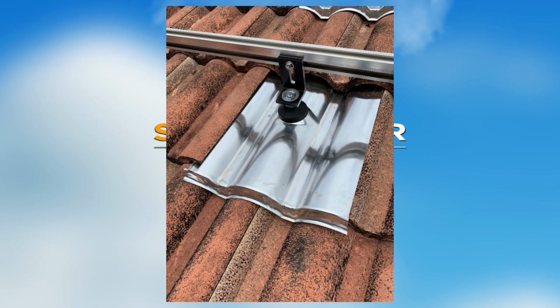So I think we have some pictures of these replacements on the roof. Do we have some of those up there? They show some of the actual installs of these. You can see the galvanized finish on those. And on this picture, you can see the rubber boot that I was mentioning I didn't bring with me, and how it's set down in there. That's why they call it a replacement: it replaces the tile and goes right into the roof, so you can see how it's mounted. If it was a different color, you wouldn't even notice it's there.